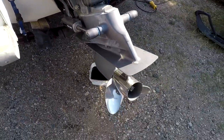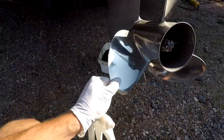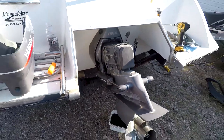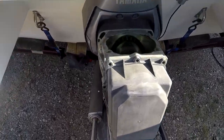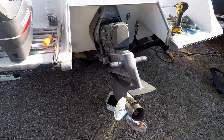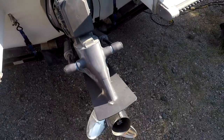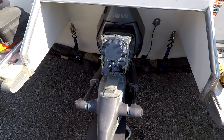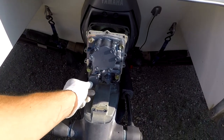This one's a little bit different than the MerCruiser. The MerCruiser is just straight gears, and this one has a clutch pack in it. I went to a shop that works on older boats and they denied there being clutch packs in this leg. I was reading on a forum where one gentleman said you cannot use synthetic oil because it will cause the clutch pack to slip — you have to use conventional oil. He also mentioned there's a screen that nobody cleans, so I thought I'd dig into it.